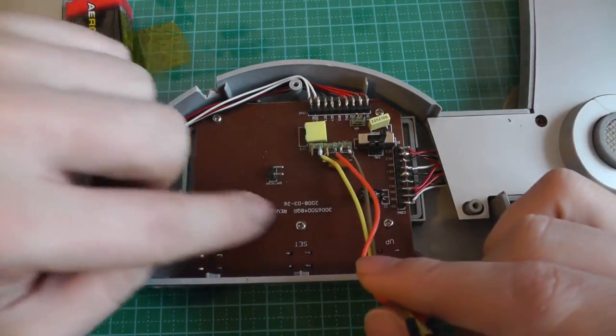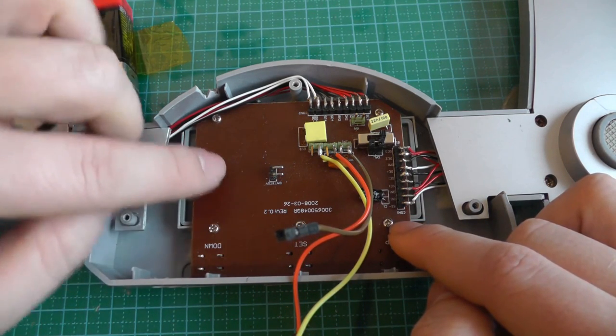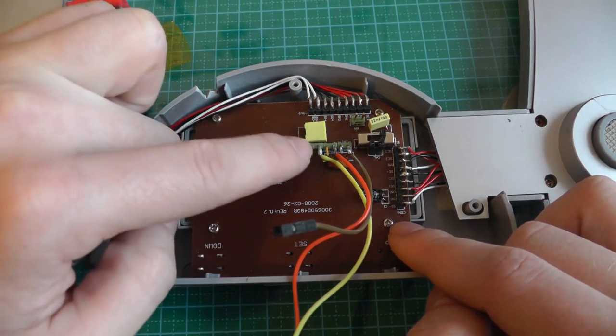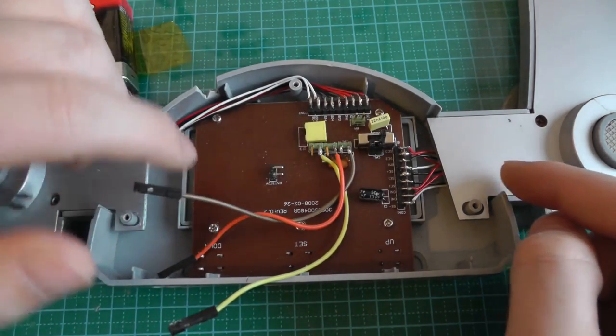We'll have a look at all these ones once we see the set, but as we can see, the board is pretty simple. We have a paper board because of the brownish color, which is just single-sided. There are no traces at all on this side. You only have some components, but not all the components. So they use a mix between surface mount components and through-hole components.